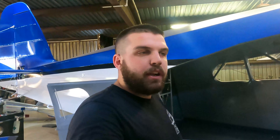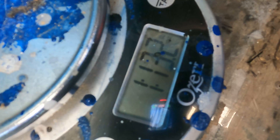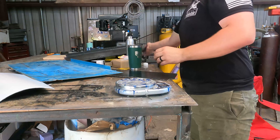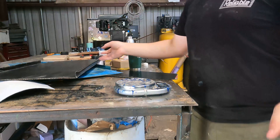On the weight side of things, our goal was to not add any weight, but we've actually saved some. These floorboards running through the back and into the front — I'll show some weights here — have saved a large amount of weight, about three to three and a half ounces per floorboard section. If you calculate that out through the whole floor, we saved somewhere in the neighborhood of five pounds versus just bare aluminum floorboards.